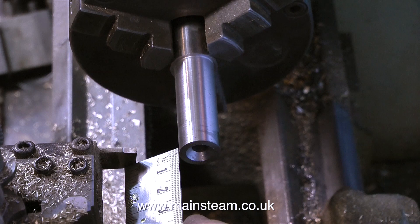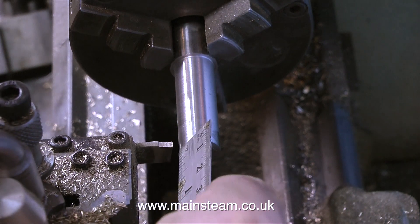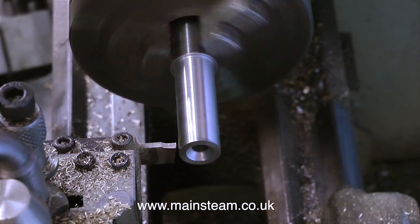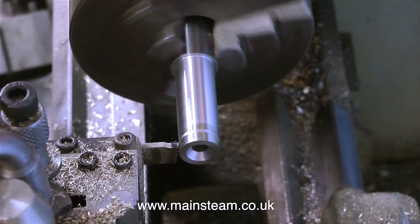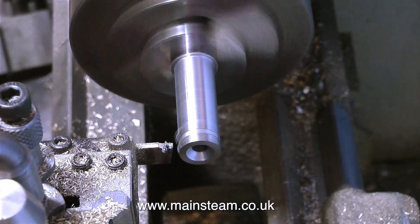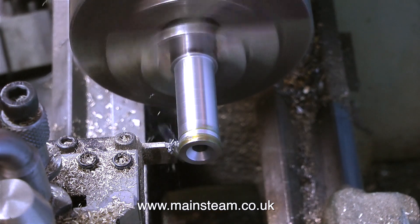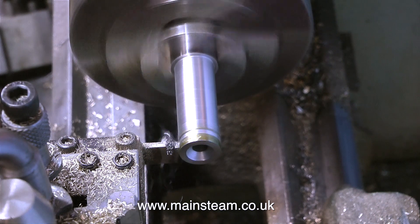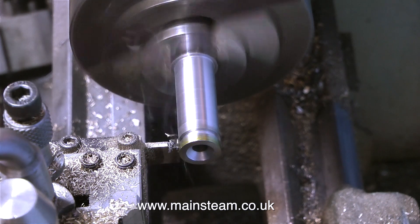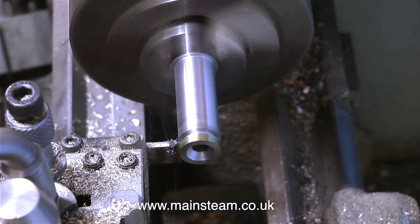I'm really sorry for the experts out there, but I think steam oil is okay - it sticks to the metal and doesn't splash everywhere. I used to use industrial coolant, but it smelled really bad. Anyway, back to the plot. I've measured the distance I want these washers to be - about an eighth of an inch. I needed to slow the chuck speed down for the countersinking, and now I've speeded it back up for the parting off. The parting tool is singing a little bit because this piece of metal is a long way out from the chuck. I have sharpened this parting tool - it's a lot sharper than it was when it was cutting the brass.